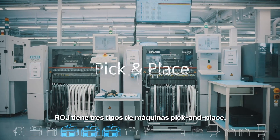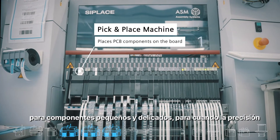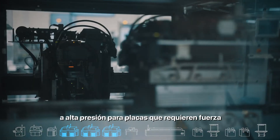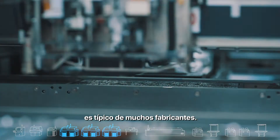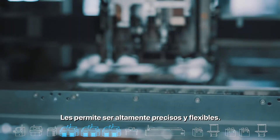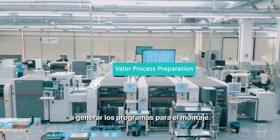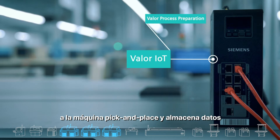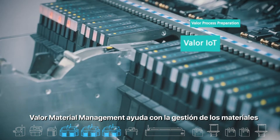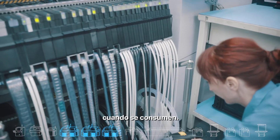Roy has three types of pick and place machines: a fast pick and place machine, a machine with a camera for small and subtle components where accuracy is highly important, and a very strong machine with high pressure for boards that require force in implementing components. Having different pick and place machines is typical to many manufacturers — it allows for high accuracy and flexibility. Valor process preparation can help in generating the assembly programs, Valor IoT manufacturing connects to collect machine utilization data, and Valor material management helps manage material on the machine and handle replacements when consumed.